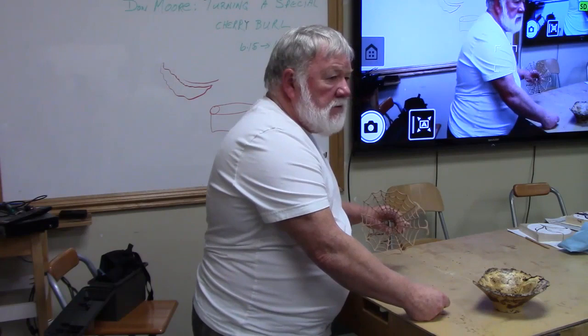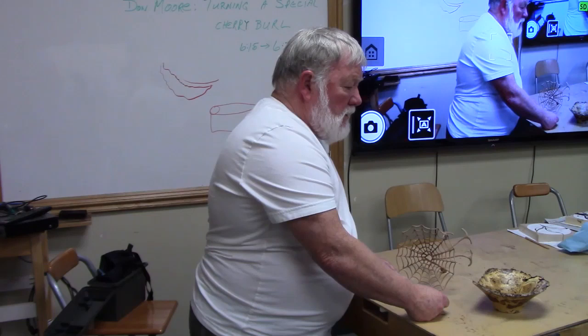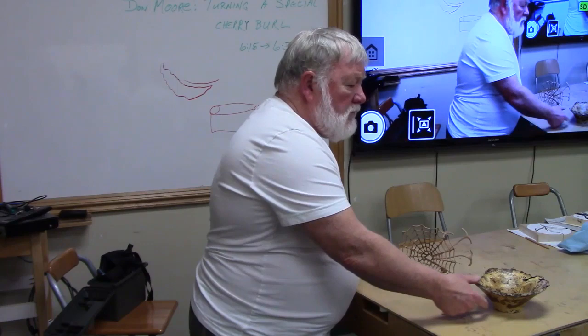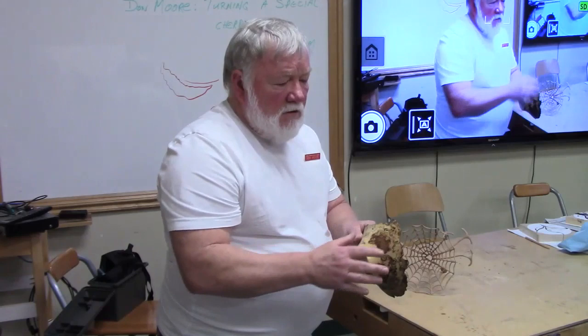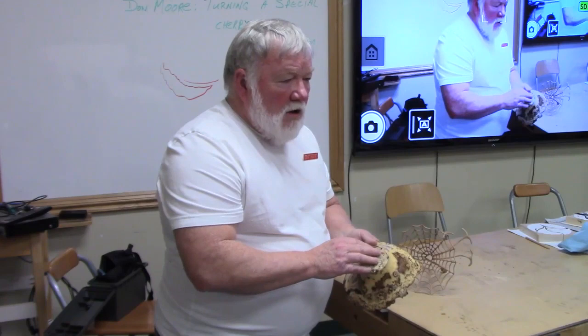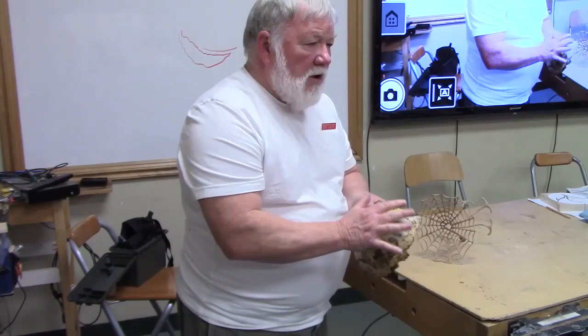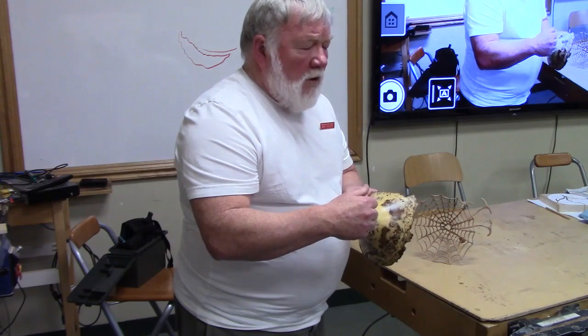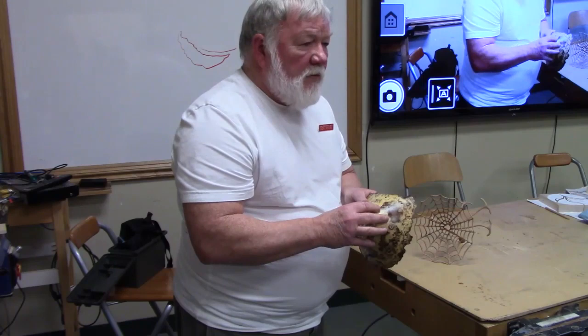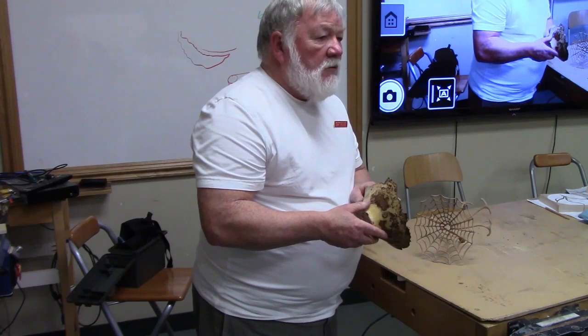If you had a piece of wood that was really punky, could you soak it in pledge, or do you just sponge it on? You could, but it's only going to go in so far. What I did with this one: I turned this outside edge so it was still an inch and a half in thickness, I didn't do anything to the outside, I took it off the lathe, I put a lot of pledge on it, and then I took a wooden block, hot melted it — I turned it to this diameter and hot melted it. The glue sticks to the pledge. I wanted it to stick really, really hard because I parted it off — I left enough material to part it off. It was going to be waste anyway; the thing I wanted was to hold it together.